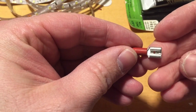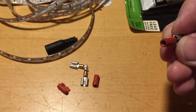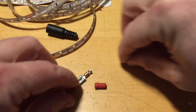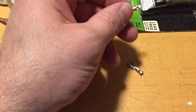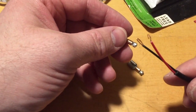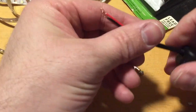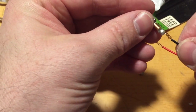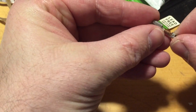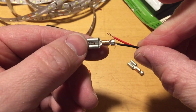The first thing you're gonna do is take one of these adapters and cut and peel off the little insulation piece — I've done that with two of them right here. Then we cut the adapter off of this end of the switch, and I'm going to take an insert and put one in each side here, then crimp and solder this right there.